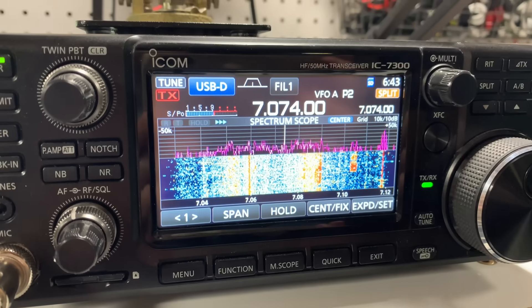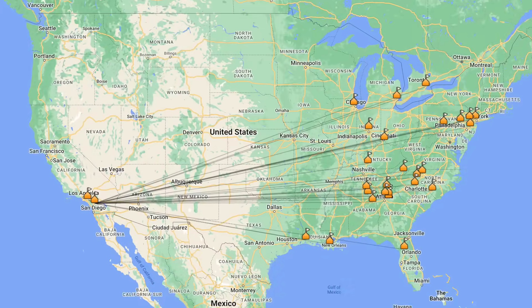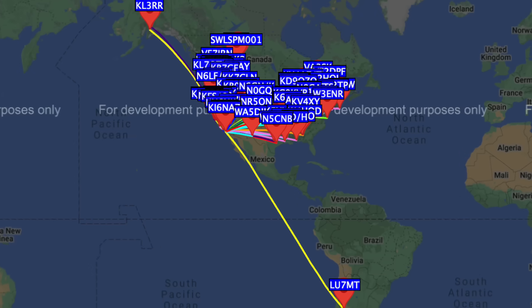Step one: we have to admit the world is not flat. Because it's a ball and because VHF/UHF transmits line-of-sight, eventually that RF is going to go out into space. We get around that by using lower-frequency radios called high frequency. Those radios, using the appropriate antennas — which are much larger — will refract their RF off of our atmosphere, giving you beyond line-of-sight communication. That's what allows hams with general and extra class licenses to make cross-country, cross-continent communications.